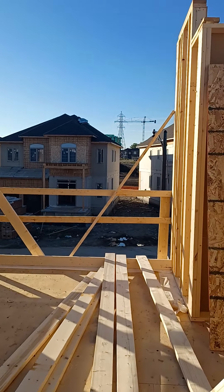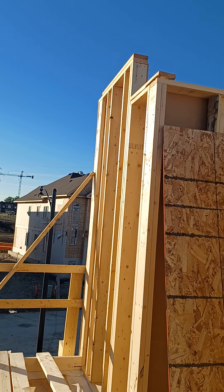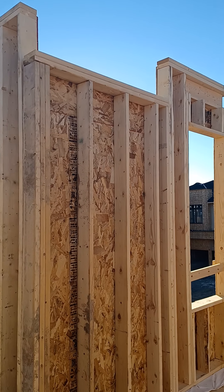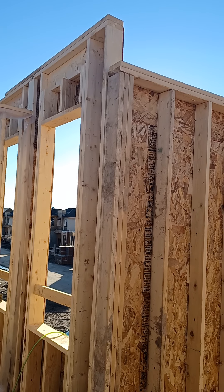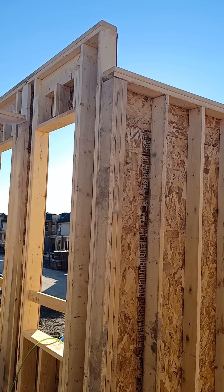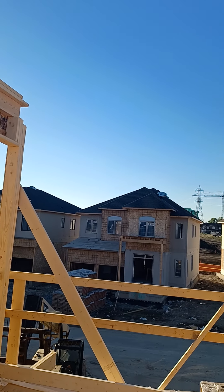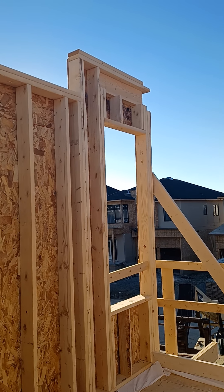Because of the height differences, getting my hands on the roof layout — you can never be sure exactly what a truss company is thinking, whether they're going to put the raises right here. It's 16-inch raises. Sometimes they put the raises in the heel so the walls stay the same, and other times they put the raises in the wall itself. That was the case here.